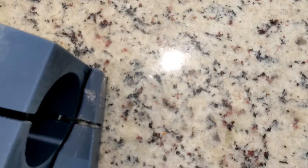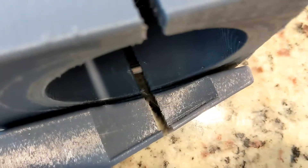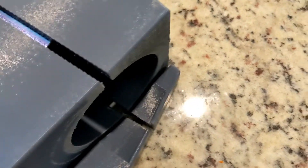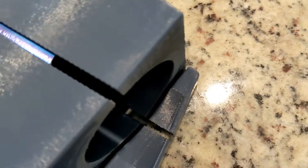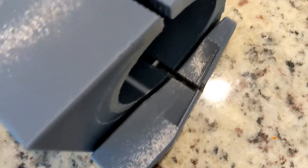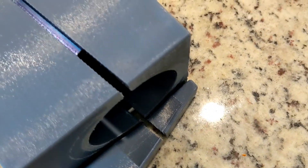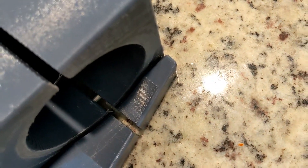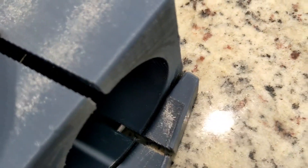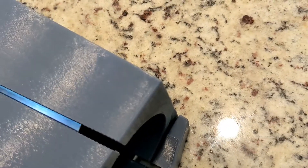So what you're going to do — you take this, you load it in your band saw, you drop your blade down into your little gap, eyeball center it. You know you're not going to be able to sand it, deburr it, and get it precision perfect. Your blade is 0.045 inches; I made this gap 0.1 inches, so you've got 0.025 on each side of the blade for clearance. Not a lot. So if your band saw doesn't cut straight you're going to get a little bit of rubbing, or based on how wide the teeth are on your blade how they bend out, it may just barely graze the edge. I print these things thick though, so don't even worry about that.